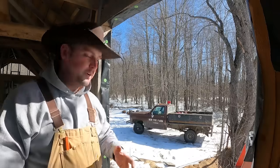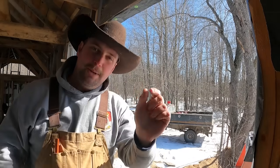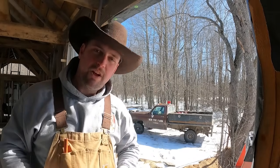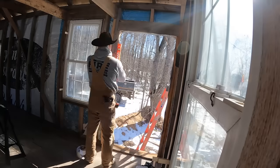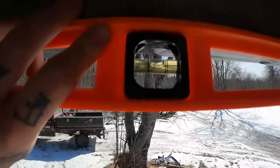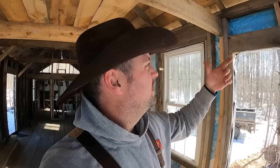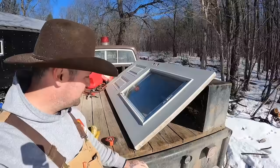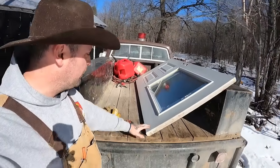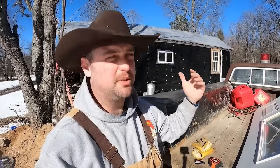Now we're going to move on to our jams. For those who don't know, the jam is the interior trim piece on the door that the hinges screw to — not to be confused with the stop, which is the little strip the door actually butts against, even further inside the jam. So we're going to measure for those all the way around. We're level here and on our header, which is good — less shimming work to do. We're going to cut our two side pieces to 80 and three-quarters, and the top piece, whatever's left. Before I cut those jams, it's a good idea to measure the door. That's a very nice door. I measure it and it's actually 79 and a quarter to the top — looks like it was trimmed down at some point. So we're going to shorten our side jams to about 79 and a half for a little wiggle room.